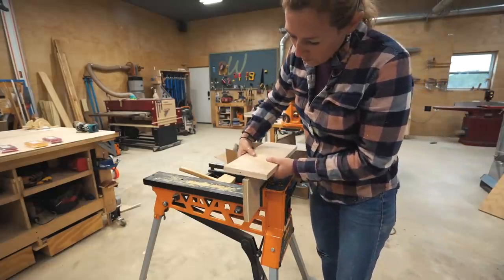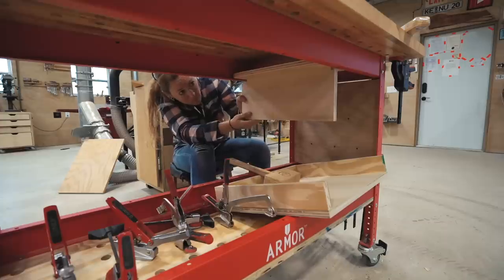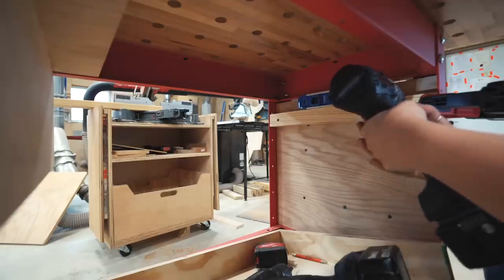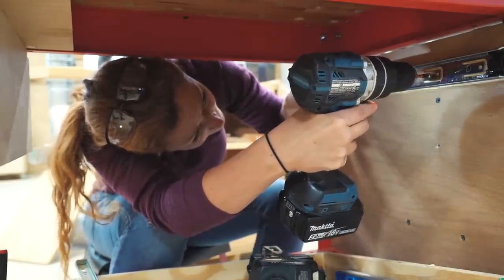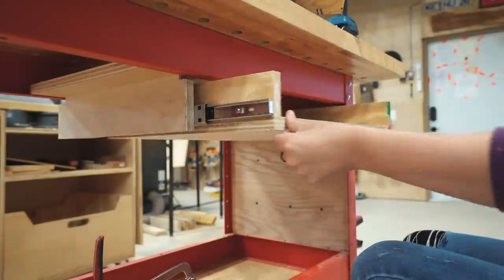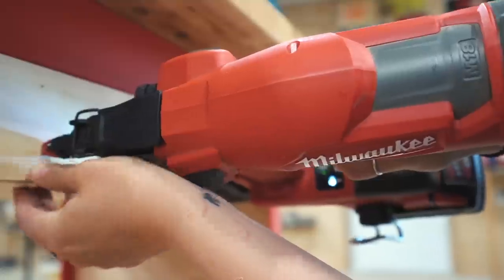The drawer is very simple construction with wood glue and brad nails. Then I made a tee that would go up and under the workbench and rest on the side flange of that apron. After getting it set to its width, I used a few sliders to insert the drawer. After getting the body of the drawer pushed in, I came back and made the face so that it would cover up the side divider.